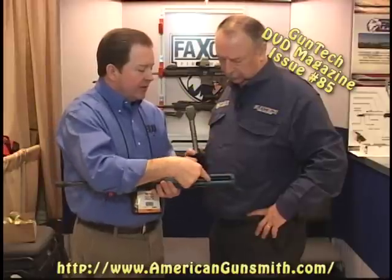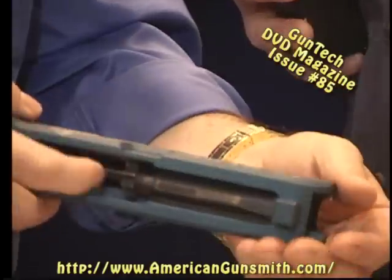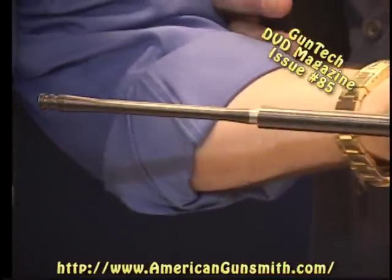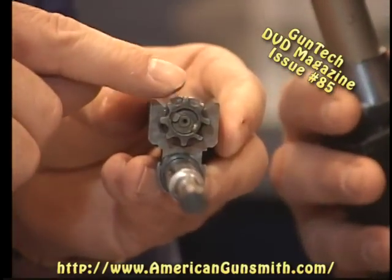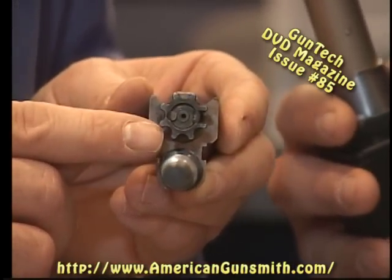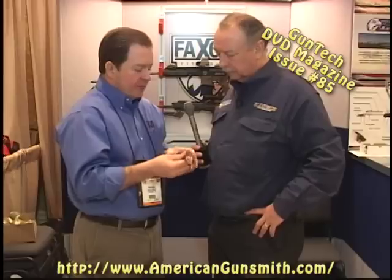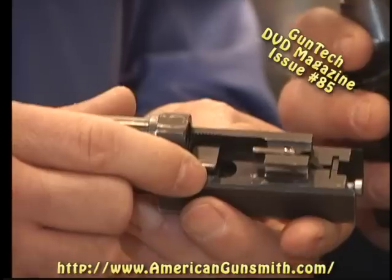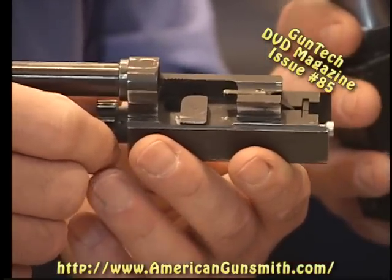The alignment of the bolt to the barrel trunnion should be zero — all machined at one time. To remove the bolt carrier, it simply slides out the back. The difference is that this bolt has eight lugs, not seven. They're rounded, not square, and the extractor is at three o'clock, not two o'clock. We offer a right and left-handed model. If you remove the cam pin, you can turn the bolt 180 degrees and it functions as a left-handed bolt, so they're not unique parts.